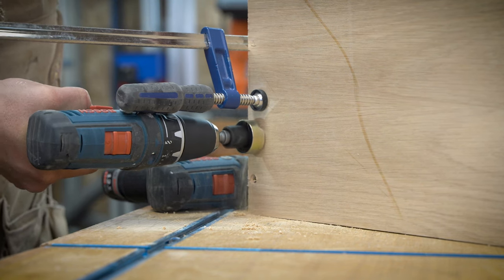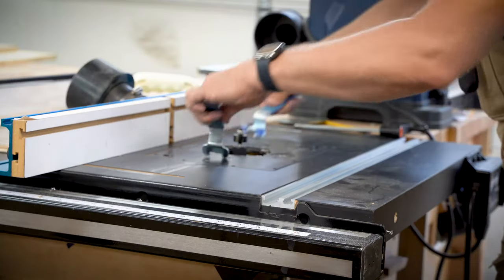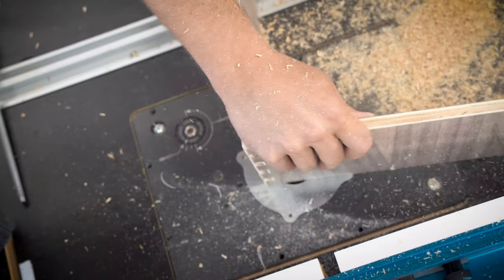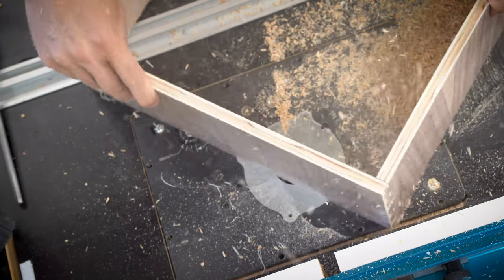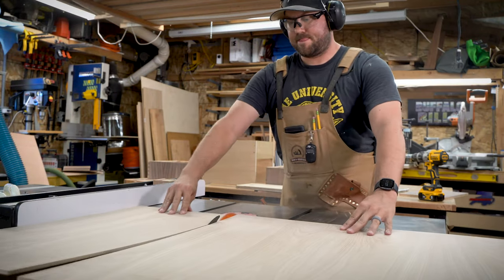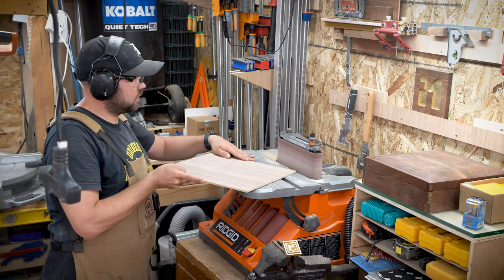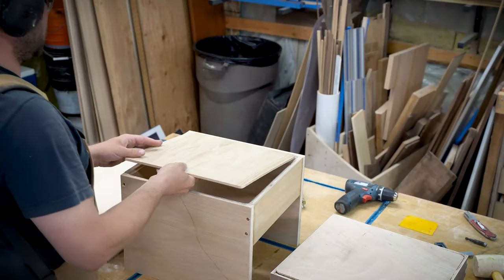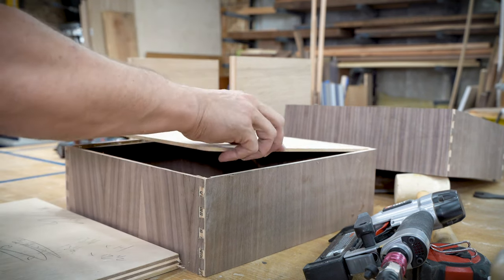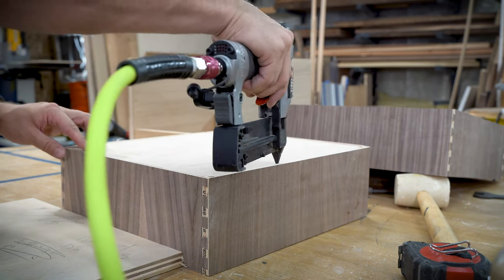You can tell I got back to the lazy train — I just screwed together the bottom drawer, which becomes the file cabinet. My favorite technique for putting in the bottom of boxes is to use a rabbeting bit on my router table lift. This allows for a nice quarter-inch inset into the boxes, and then I can take a piece of quarter-inch plywood, round it over on the Ridgid belt sander, pop it right in, put on some glue, add some nails, and you've got a box — which becomes a drawer once you add drawer slides.